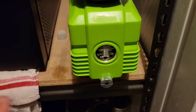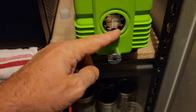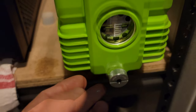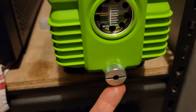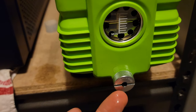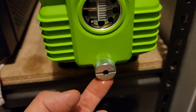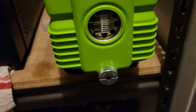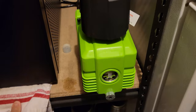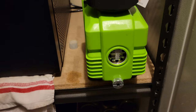The only other thing it might be that I can see visibly is that this pump leaks a little oil through the glass right there — not much, but a little bit. And even though the valve is shut, it still leaks a little bit right there. I think that's just a loose seal or something. We'll do this last — I'll try the other fix first, because fixing the pump would be the most costly part. That valve I can get for a few bucks at the hardware store, so I'm going to try that first.